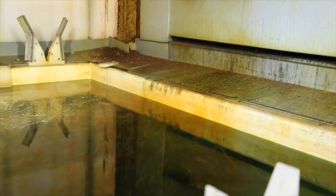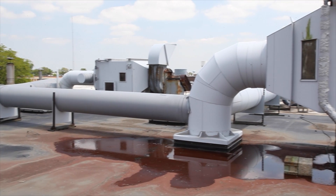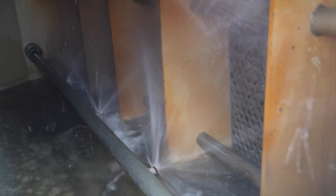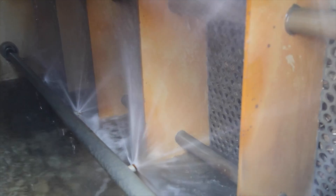We are also concerned at Arlington Plating Company with cleaning the air. In addition to cleaning the water in the plant, we also have fumes that come off of our process solutions. These fumes are vented into a fume scrubber. Here you'll see a fume scrubber, where we're venting the air from the process chemistry. Those fumes are then transferred into a chamber where the contaminants are cleansed with water, and then that water is channeled to our wastewater treatment system for further treatment.